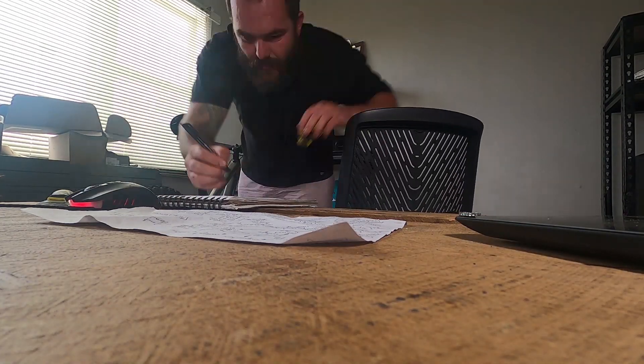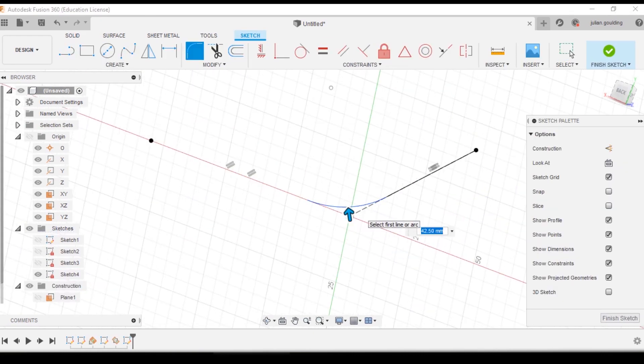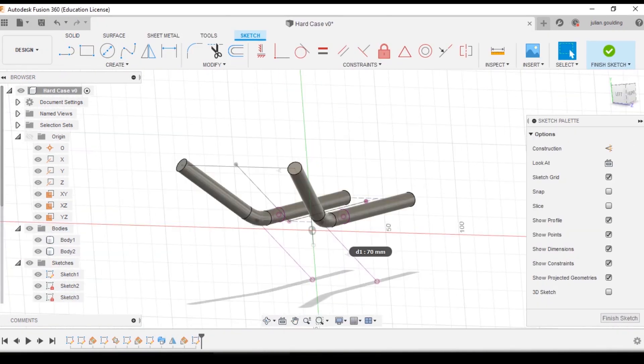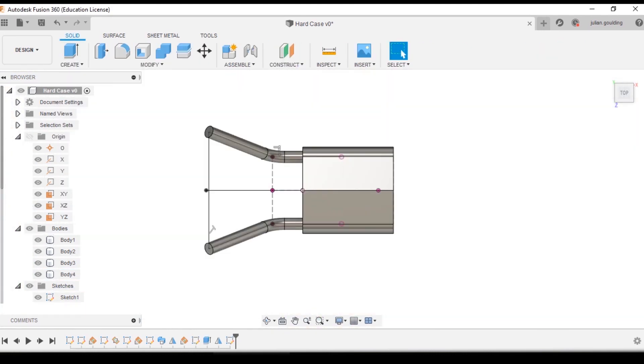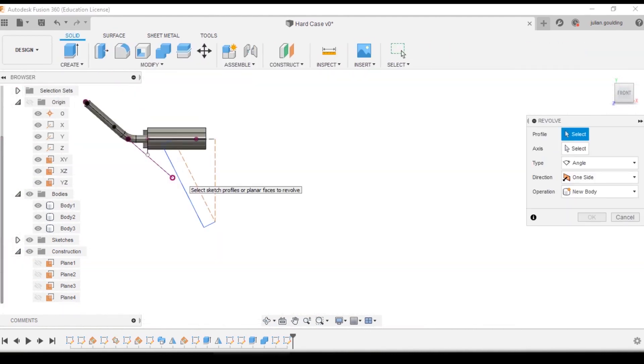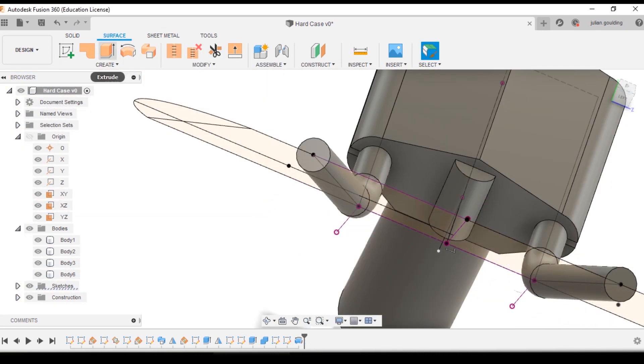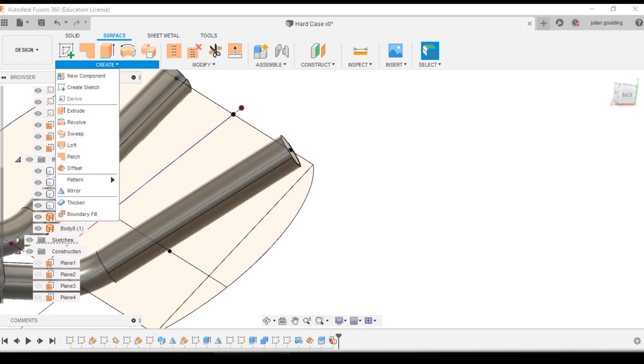The first step here is to build what I call a reference sketch. I took a whole lot of measurements from the seat itself and then built a 3D geometry around what's existing. The most important bits are the seat rails and where the seat post touches the seat itself — all the bits that are going to get in the way when I come to model this thing. I'll quickly print off a few test pieces so I can check the fit and make sure I've got all the angles right. I can adjust the model while that prints. While it prints, I'll do a few sketches to get my head around what this thing's going to actually look like. All I'm doing is capturing the surfaces of the touch points of this model.